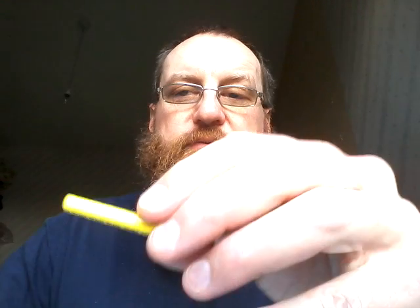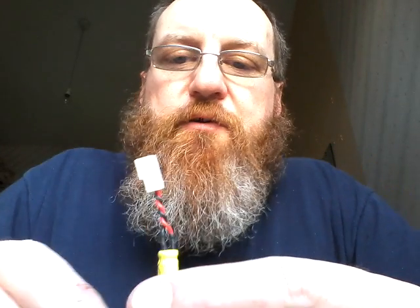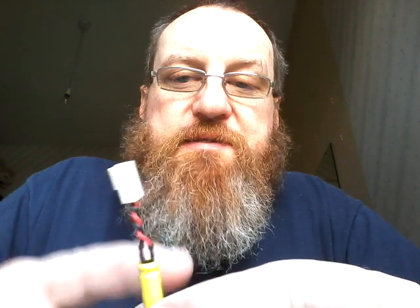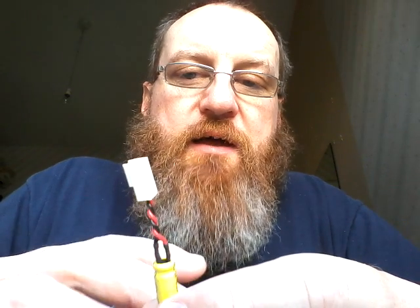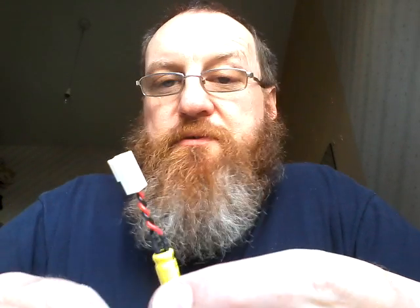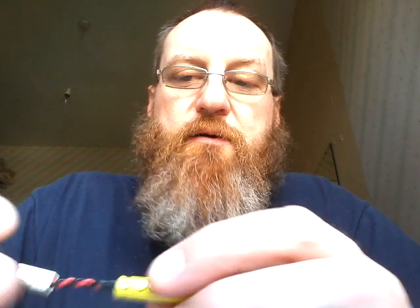So I took one out of the other electronic cigarette and put a connector on it. It's got two pins that stick out, a bit like a capacitor. If you look at the other video where I took one of these apart, you'll see why — basically there are two sheets of foil inside coated with the lithium compound, and two dielectric separators, and a wire is bonded to the middle of each sheet and comes out through a grommet. I wouldn't apply too much heat, in case you melt the dielectric insulating layer between the layers and cause a little bit of a meltdown.